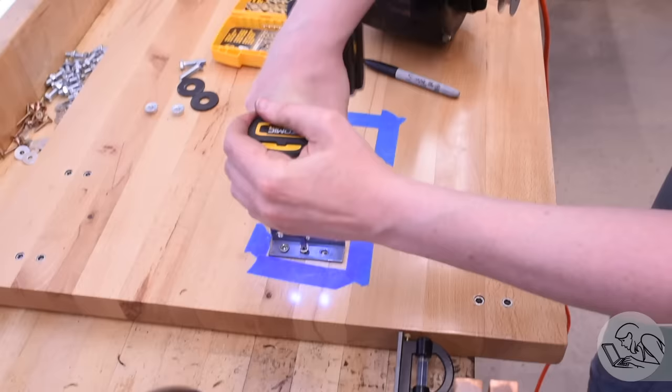Now I should be able to get the motor mounted underneath and position the die filer relative to that. If I did all my measuring correctly, the belt will line up with the slot — I guess we're going to find out. Hopefully this is the last time I need to bolt the motor up underneath here. There is a fair bit of adjustment on all of these mounts, so if I don't get the slot alignment perfect, I do have a good half inch or so of room to shift things around.